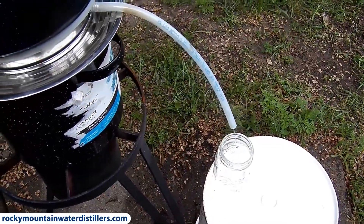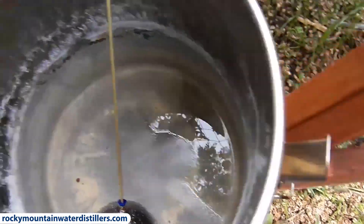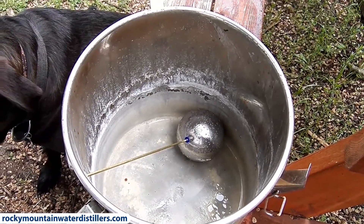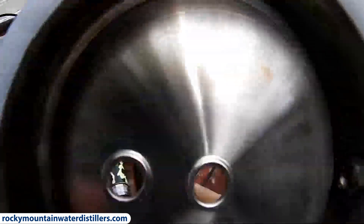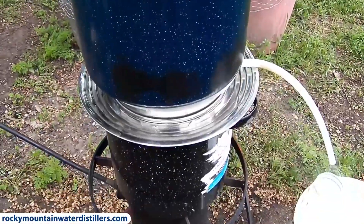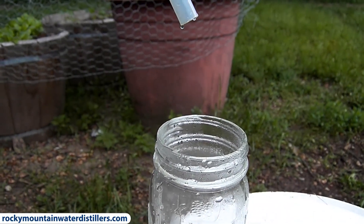We're going to run this for a while and then test the water to see what it looks like — going from seawater salt levels and nasty muck to purified drinking water. Our Gravistil system, which is our larger distiller, has a float mechanism so it automatically monitors and fills the boiling chamber. With our feeder tube coming out of the condensing section and the collection plate on top, you don't have to manually fill the system — it can run continuously. But that just gives you the difference between the two products.